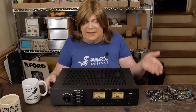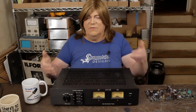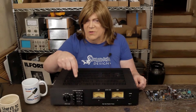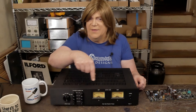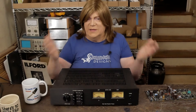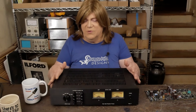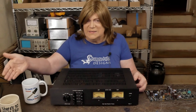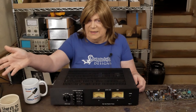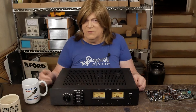This seems to be an ideal candidate for this conversion because it's two-track, 15 IPS, and reasonably priced. It has that special center tape head that's record and play — they call it a sync or record head — so you can play off that center head too. And it's got a repro head so you can monitor the recording while recording on the next head. So doing this really doesn't affect the usability of the deck for other purposes, and you still have NAB EQ functionality while adding the ability to have IEC EQ, which the original deck wasn't switchable between.